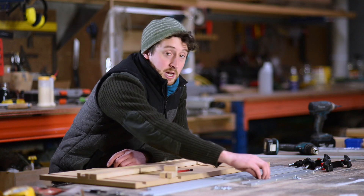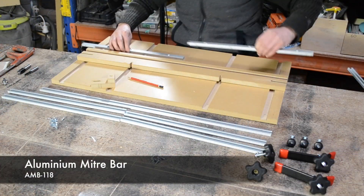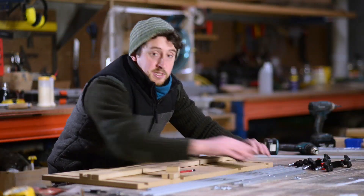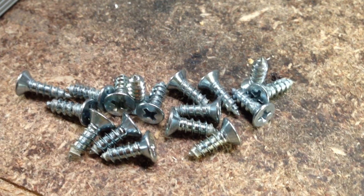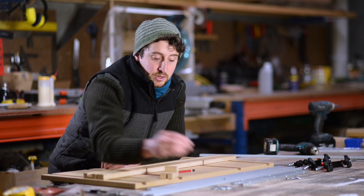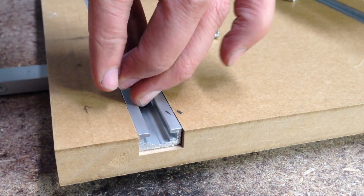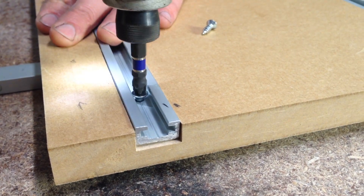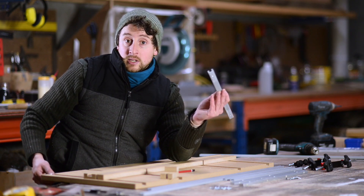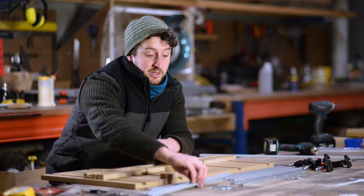As well as your T-Track you also have two miter sliders — these are 450 mils long each and they will sit next to each other on the underside of your jig. There are enough screws in the packet to do all the bits and pieces you need. The screws for the miter sliders are a little bit thicker than the screws for the T-Tracks. You'll need to pre-drill the T-Track with a 4 mil drill bit. You don't need to countersink them even though they are countersunk screws — if you do countersink them the screws will end up going through the 18 mil board. It is important that you are using 18 mil board or above; if you use 16 mil, those screws will come through the bottom and won't be any good for your jig because it won't slide along your table saw.